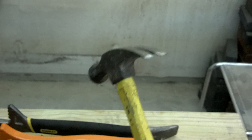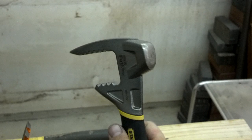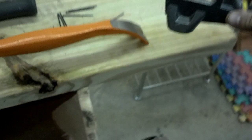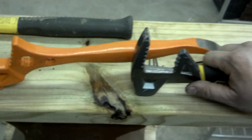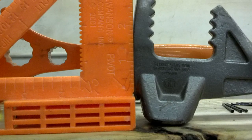You can never go wrong with the correct tool. The claw hammer was designed with a good balance, weight up at the head, a good swing, and it doesn't kill you because it's actually quite light — but that weight up top gives you a nice impact. The Stanley's nice, but I don't like the offset in the head. You can't hammer up into corners. Trying to get into a tight 90-degree corner, you're going to be technically about three-eighths of an inch away from the wall — absolutely useless. Compare that to the old school hammer and you could certainly get into tight corners.